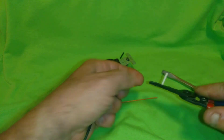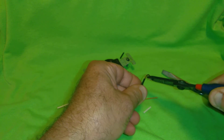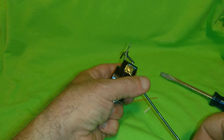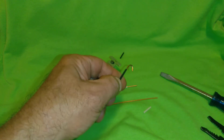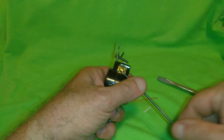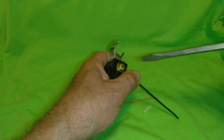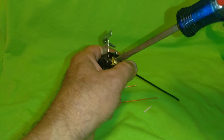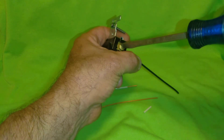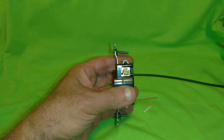What you do is take your wire and make a loop in the direction that the screw turns. You put it under the screw like that. Then take your pliers and close your loop so that the wire is almost hugging the inside of the screw head. You can take your two fingers and pull back on that wire so that all of the copper is under the head of the screw. In a real situation, I would snug that down tight — and that is what it should look like.